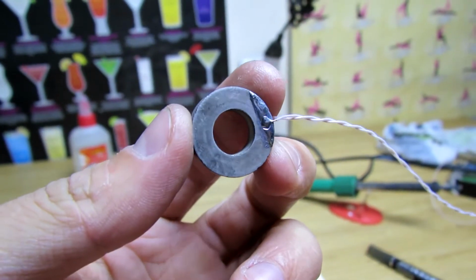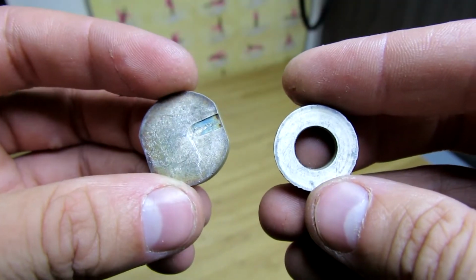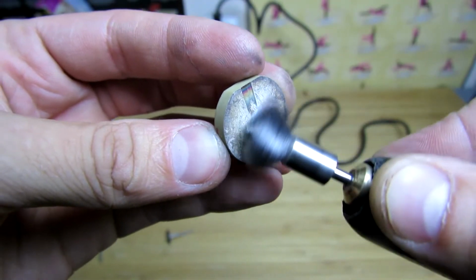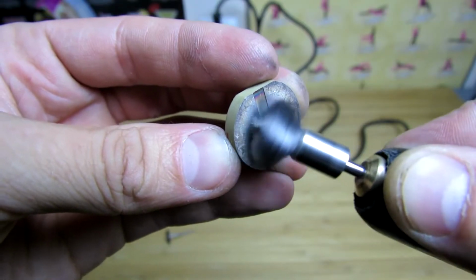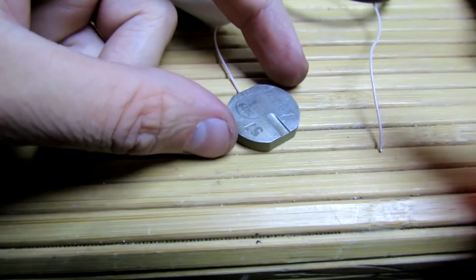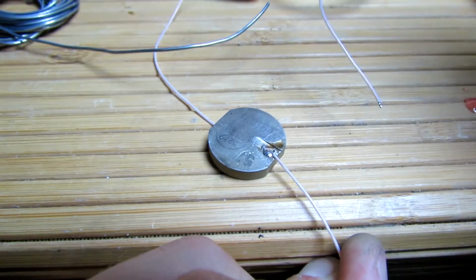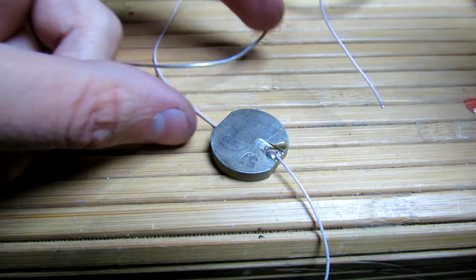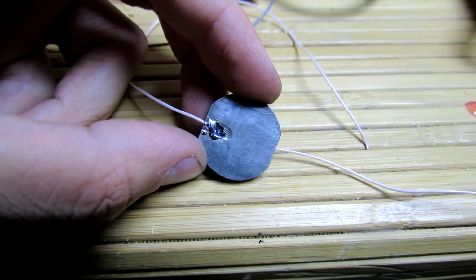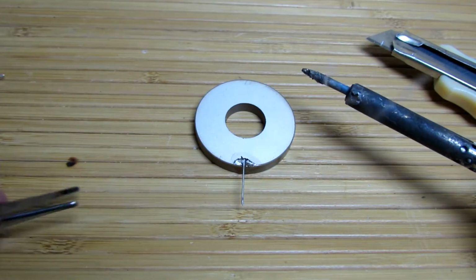Before doing this, solder the wires to the washers. The contacts in the Soviet samples are silver-plated, therefore they darkened somewhat over time. We clean the surface to a mirror shine. All markings and inscriptions on the metal are visible now. We will solder the wires using acid and a powerful soldering iron. You need to do this with one quick touch, so that nothing is overheated. Wires must be flexible. The fine silver spraying is very delicate to external loads.